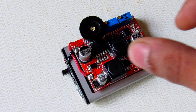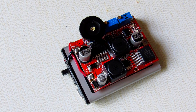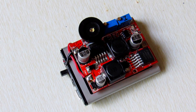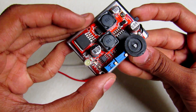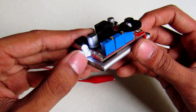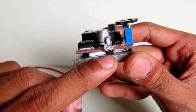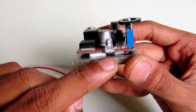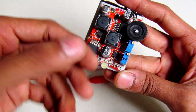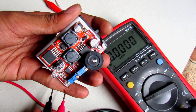Additionally, you can connect a small panel voltmeter to this power supply to read the output voltage. I've also connected an LED as a power indicator, and I've connected a diode in reverse polarity to protect the power supply from inductive EMFs when using inductive loads.